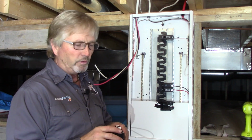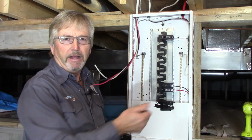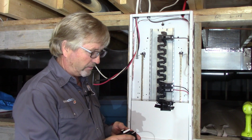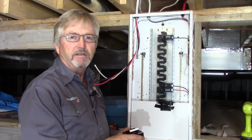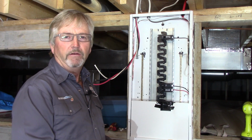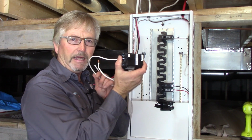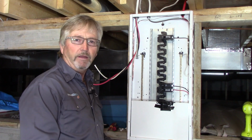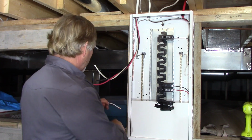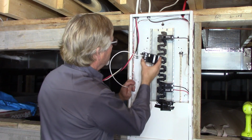So that would say you and your wet little body jumped out and you happened to, terminal popped out inside the spa pack and was sitting on the ground, which is highly unlikely because that would have tripped the breaker. But just some reason there's a fault in your tub, maybe in the windings of the motor, and you are in the tub and you put one foot on the nice wet ground, then there could be a little bit of current passing through you into the ground, and this thing is going to say, "That ain't right," and it's going to trip. That's why we have ground fault circuit protection on anything to do with wet conditions or swimming, etc.